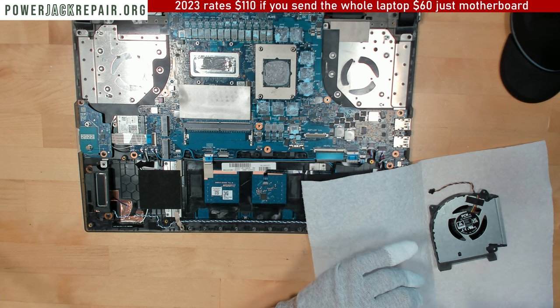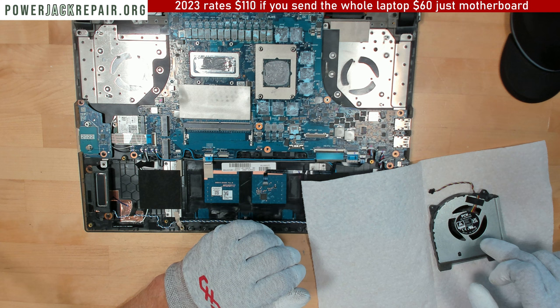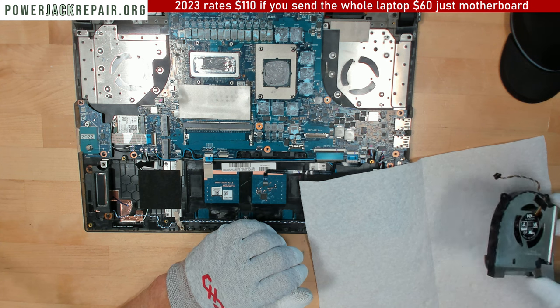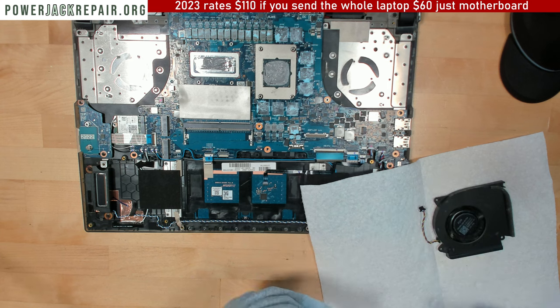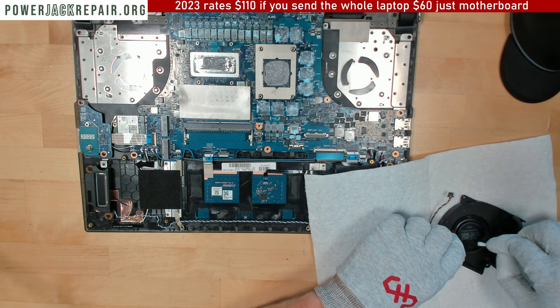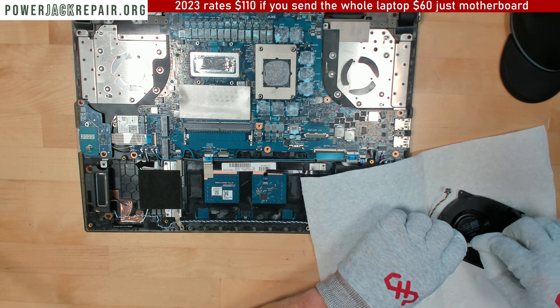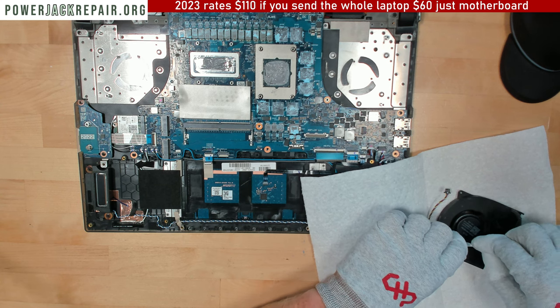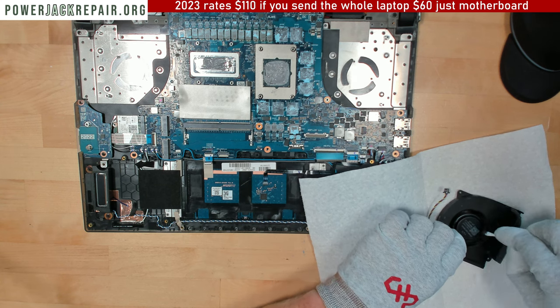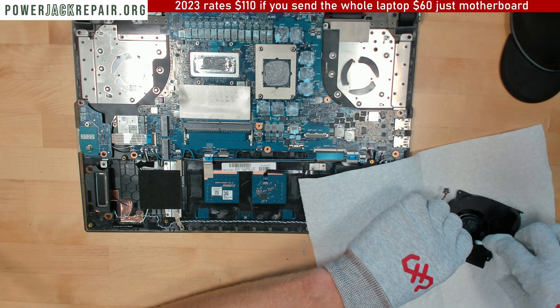And the problem with cleaning those fans is that on the other side, the dust gonna be collected underneath between the blades and the metal casing. So when I'm trying to wipe it off right now, many times people complain that there is a noise coming from the fan, and the reason the noise is coming is because all of this stuff that's being accumulated. And I could tell you this is the minimum amount of dust, but that's all it takes for $4,000 to come to waste. I mean, I could see damage right there already to the CPU.